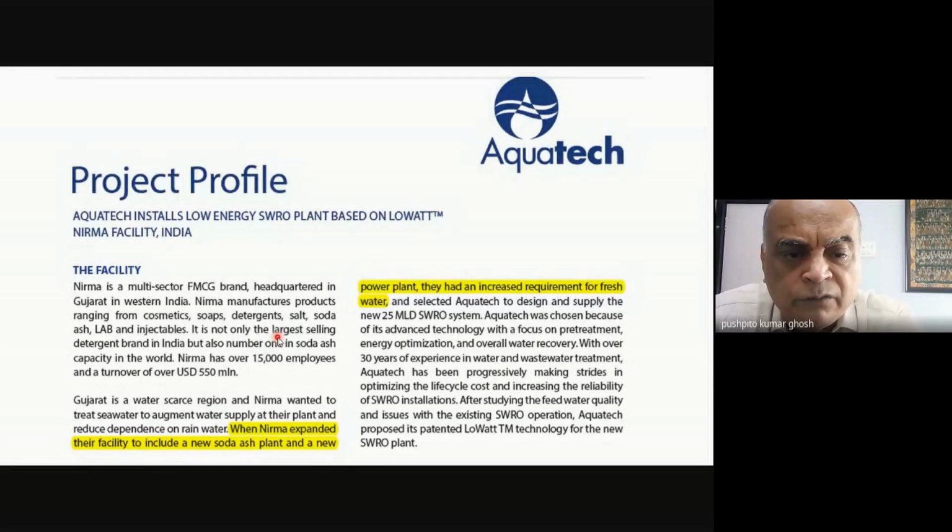And so all of these people typically have to set up their own seawater desalination plant, so that they can make fresh water. Because you cannot dissolve the salt in seawater. I mean, you can, but then there would be so much impurity that the purification of the brine you would have to do would make it a costly proposition. So nobody would do that. You want good quality water. We'll also see what the problem is with all the other impurities present in seawater and how those might interfere with your soda ash Solvay process.